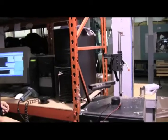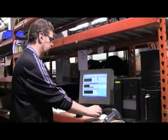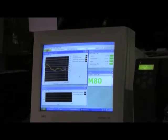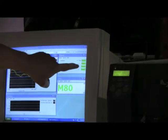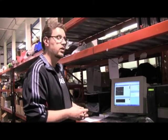It's about three seconds for that noise to happen. In this test box, where we have a microphone mounted — it's like a mini anechoic chamber — we're able to measure not only the frequency response or amplitude response of the drive unit, but we're also measuring the impedance, measuring for any buzzes or mechanical noises, and measuring distortion. All of those things are measured individually, and each one will get a green light or a pass if they are within specification. We determine our own tolerances, and they're very, very tight. On something like a tweeter, a dB and a half is our measurement window, which is very hard to achieve if you're buying tweeters from another company rather than making them yourself.